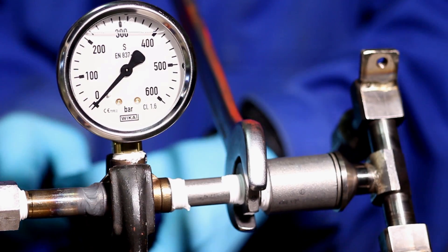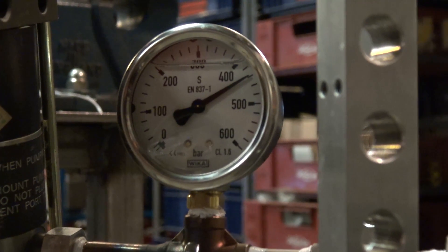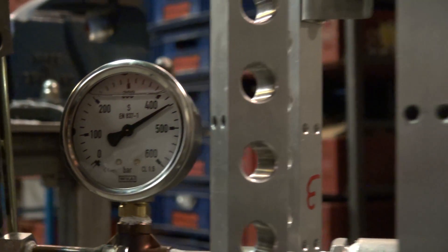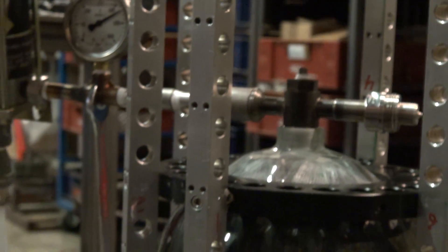In this case, as we expected, the tank held up just nicely to 440 bar, which means we can confidently fill it up to around 300 bars and walk right next to it.